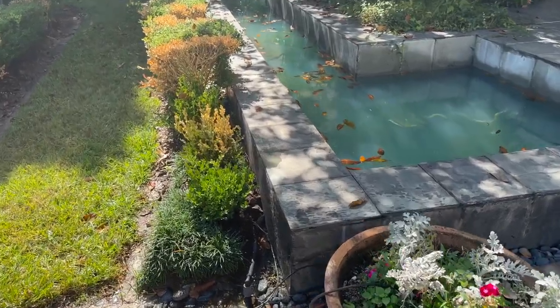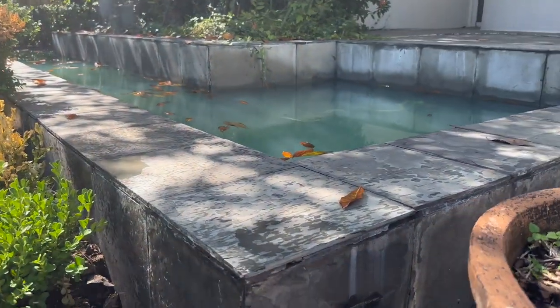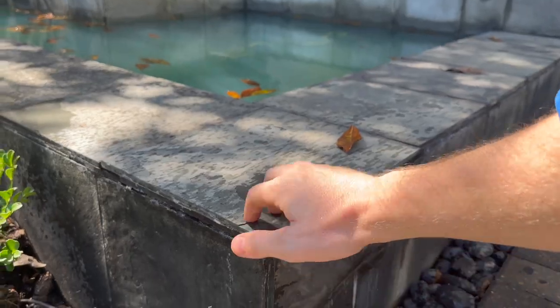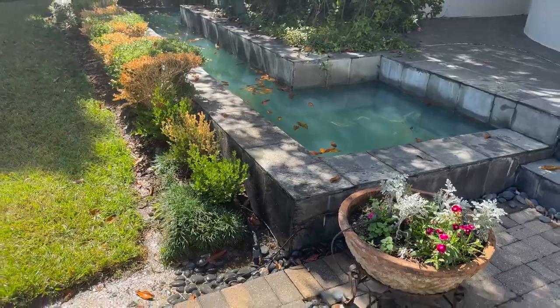Whenever you can see a lot of efflorescence, it could be from the sprinkler system, but it damages the tiles, so keep an eye out for that and inform the client they're going to need some tile repairs. Those are some minor finds — signs that it's been worked on in the past — but the number one place you're always going to find stucco damage is on the balconies. We have two balconies like this, so check this out.